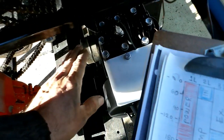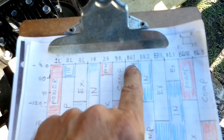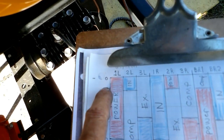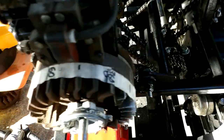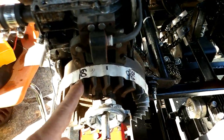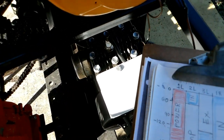So I'm trying to time bottom row 1 here. Here's bottom row 1 — it fires when 1L is at 60 degrees. That's why I'm 60 degrees past top dead center on 1L. So now I can hook the chain up to BL1.